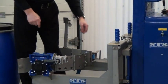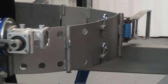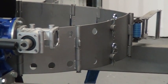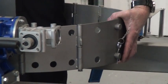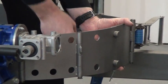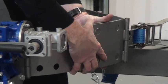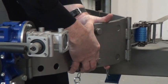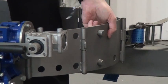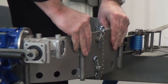Here at the back we have two pins and there's a series of holes. What we can do is disconnect the band and slot it closer together to reduce the circumference of the back band to go around the drum. First thing to do, pull out the pins — there are two R pins, these are the locking pins. We hold onto the band, disconnect it, and then move it closer into the next position. As soon as they're connected through, we put the R pins back in — that locks the band section together.